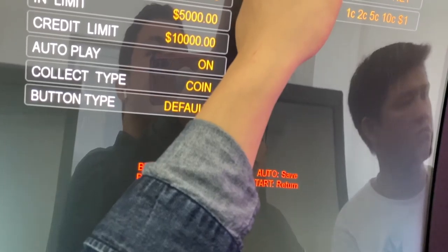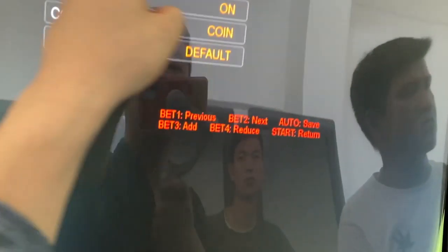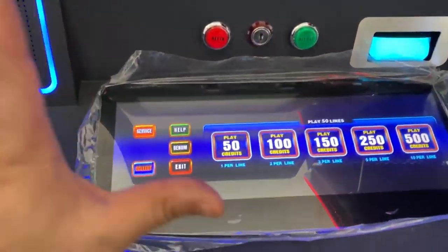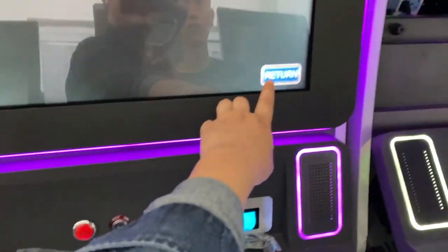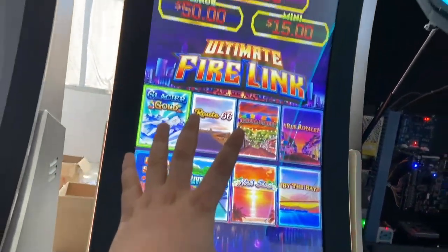You see, this is the machine type. Now it's stand alone. You are supposed to choose stand alone. And then you are supposed to choose the ID number. You see, machine ID setup. Now, I just said number three, so we'll choose number three, okay? After we set it, press save. You see, it has been connected. This is working normally right now. All right, and then you're supposed to press return, and then it is working normally, okay?